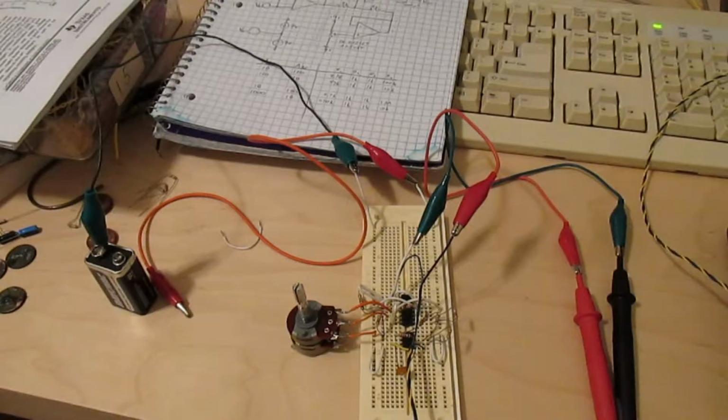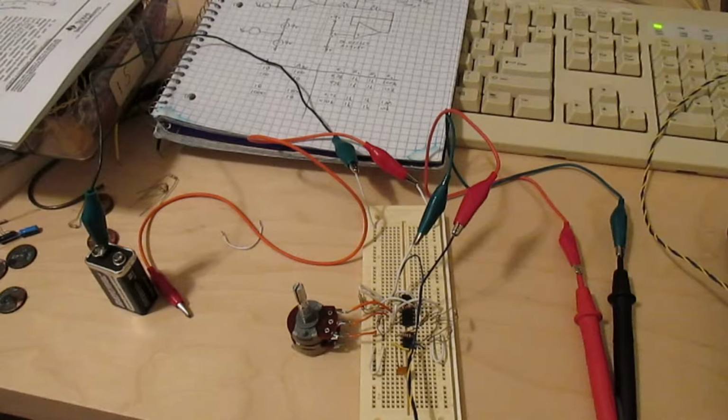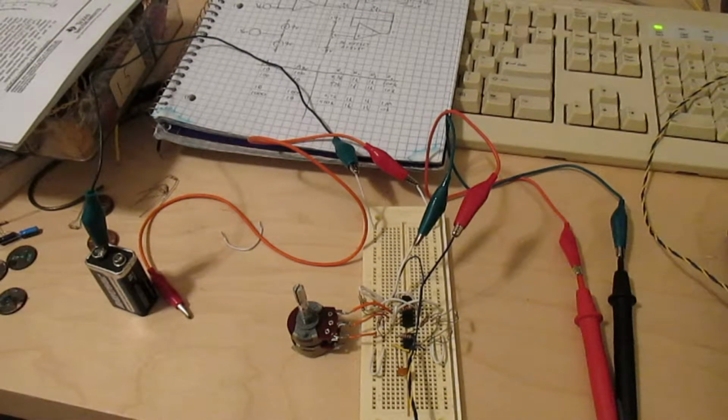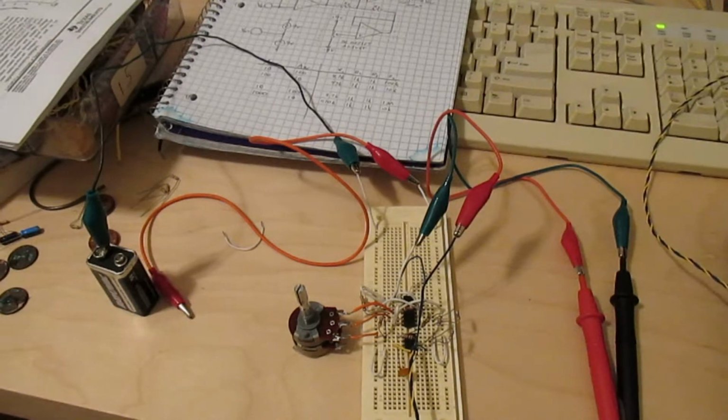So last time my EEG worked fine, and everything just sort of worked, except for that one part in the recording where it didn't just work. Well, I should have paid more attention to that, because it turns out I still have problems with DC offset. So I talked to my friend who did EEG work, and he said that, yes, not only will the electrode skin interface generate its own voltage, but that voltage will actually be on the order of a volt. And not only that, but it's pretty heavily dependent on how much pressure you put on the electrode. So that's bad news bears for me, but it might not actually be that bad.